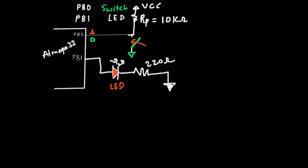We'll make port B0 as input and read the value. Normally it would be 1. I'll show you the switch when I demonstrate - I'll be using a tactile switch. Whenever it is released it is not pushed, we'll have 1 and we'll turn on the LED. Whenever we press the switch we'll get a zero and we'll turn off the LED.